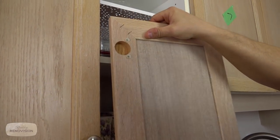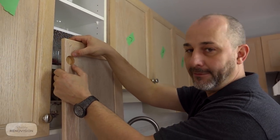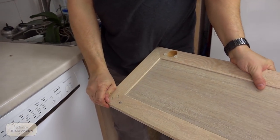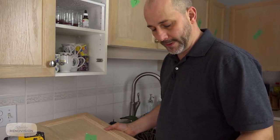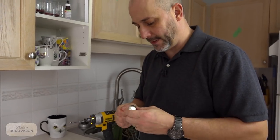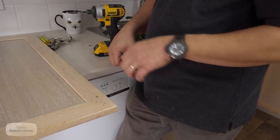These little plastic plugs are actually really important — they're in the oak wood to receive the screw. When refinishing these cabinets, leave the plugs alone. Remove the little damper tabs that keep the door from being noisy when you close it, and remove your handles. If you want to keep the hardware, you'll save a lot of steps. But if your hardware dates your kitchen and you want something new, you can save this hole and drill a new hole with new hardware, or buy hardware with the same hole dimension so you won't have to fill and sand the door.